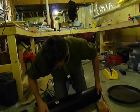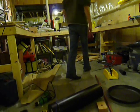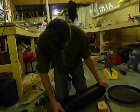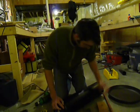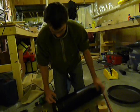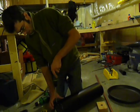One of the items that I forgot to mention that we needed was obviously a screwdriver. You will need a screwdriver to drive in these 2.5-inch screws. That's basically what we're doing here. You push in, you make sure the holes still line up. And with the wood secured in the bottom, which you know is flush to the top of the cap because that is the extreme, you push in. You can just do the next one and keep going.